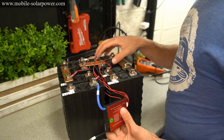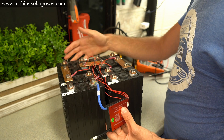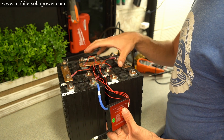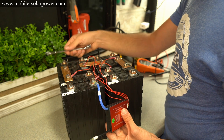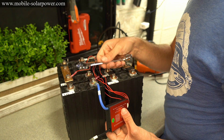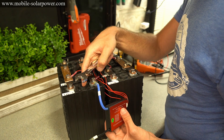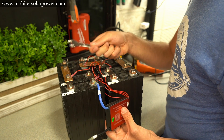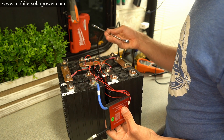If you're building large battery banks with these cells, you need to make an enclosure where an insulator — like plexiglass — covers all of the terminals. If you drop a tool across one of these terminals, sparks will fly and it can possibly damage the cells, because they will push as much current as they can through that conductor. This can be very dangerous, so you want to cover and protect this battery as much as you can.